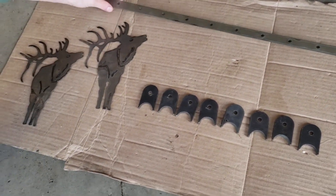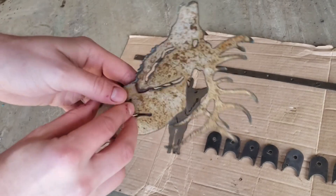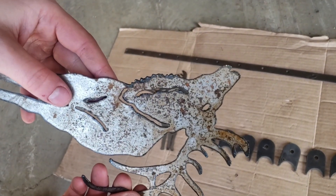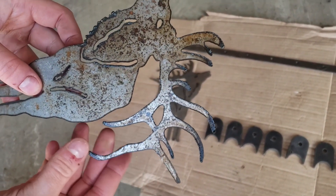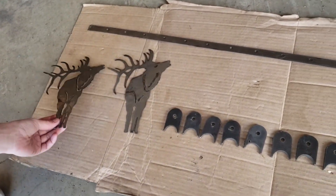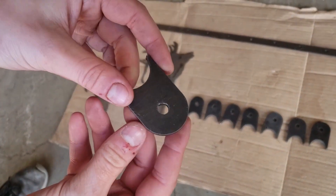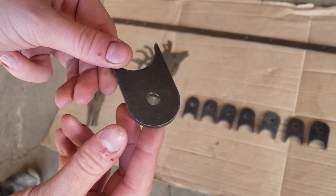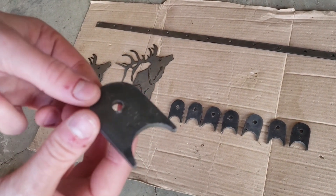We did manage to cut out a couple of elk. There's almost no dross except where it goes around a real slow area — like on the elk's beard you can see it got a little bit of dross, but very little anywhere else. Very little heat transfer to the horns; seemed to turn out good. That's 18-gauge metal, so it's fairly thin. We also cut these tabs out and they seem to turn out real good as well — this is 3/16ths metal. None of this has had any cleanup done on it. We're just getting some profiles set for different thicknesses and it looks like the table's working well.